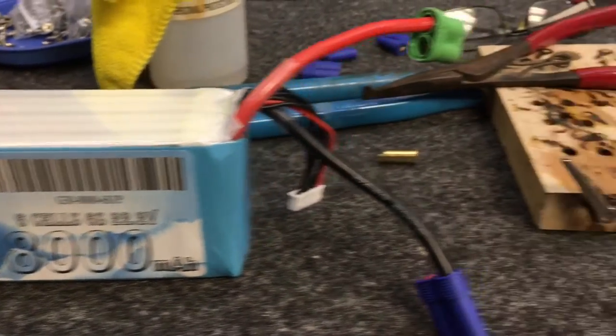Good afternoon, my name is Joe Cashwell with RotorCraftRC. Today we're doing another soldering video. One of our customers purchases the Glacier Lipos from BuddyRC and ships them to us, and what we do is take off the EC5 — a five millimeter connector — and put on a Castle 6.5. There's a little bit of a soldering trick with the Castle 6.5s: you have to push the wire through, solder it, then pull it back. We have a couple little tricks for doing this. We hope you enjoy the video and learn something, so we're just going to go through the steps of how we do it.